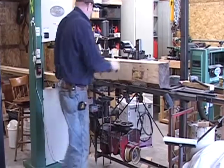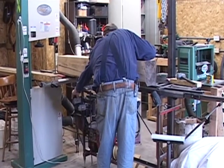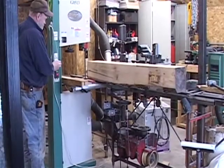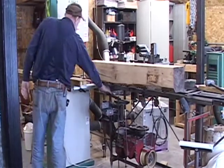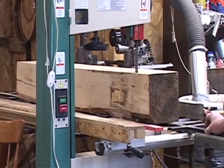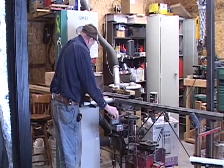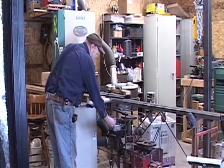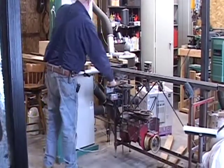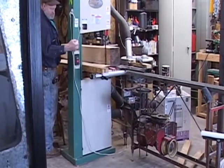The operator stops the forward motion and engages the knee drive to adjust the thickness of the cut. He engages the saw, starts the dust collector and makes the first cut. He then reverses the knee to give the saw clearance for the return of the carriage and re-engages the drive in reverse. Shutting the saw off and the dust collector off, he removes the waste wood and prepares to make the next cut.